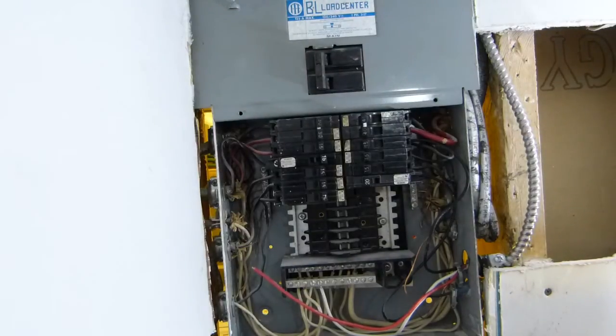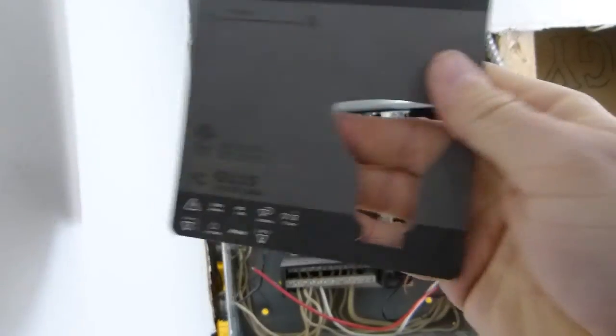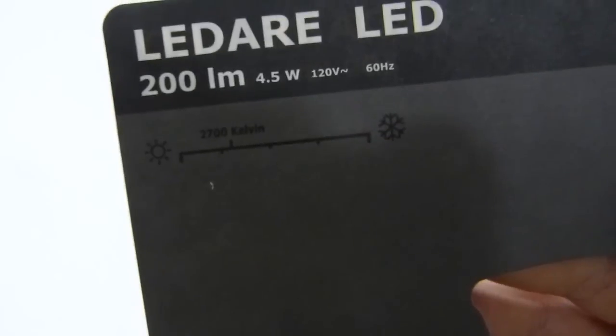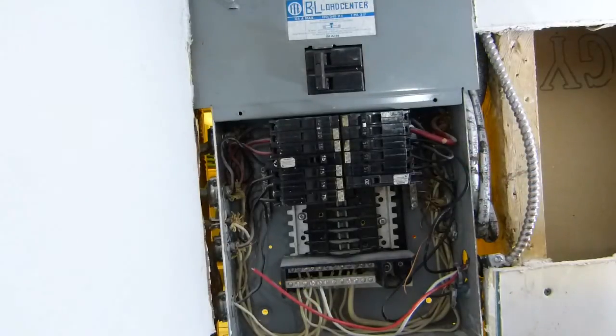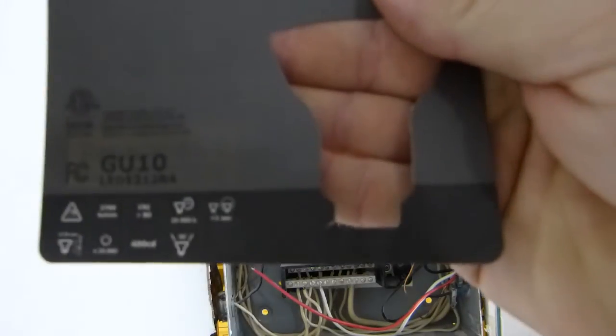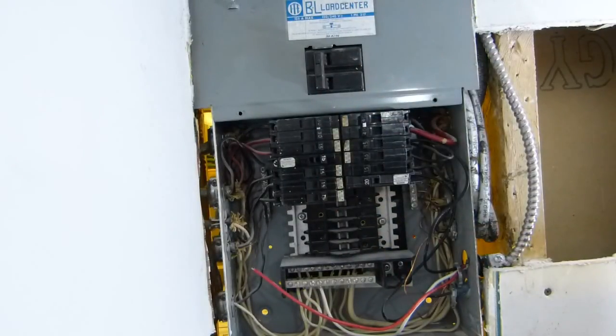This armor cable, just to let you know, I installed it — I installed 18 light bulbs like this. They are GU10 socket light bulbs, four and a half watts each. So when all 18 of them are going, that draws a total of 0.6 amps, and it's going onto its own 15-amp breaker. Because of their GU10 socket, these are not threaded bulbs — you cannot upgrade them to a halogen or any other type that the socket can't take. So there's no way you can draw a larger load than 0.6 amps on this circuit — that's fine.